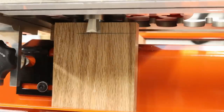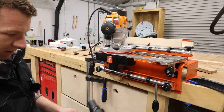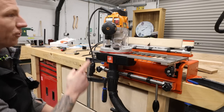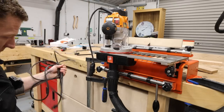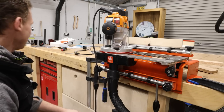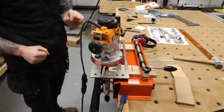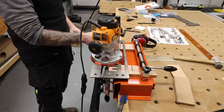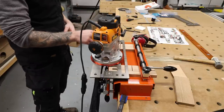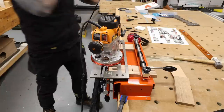We're almost ready to make the cut. I'll attach the vacuum attachment — it's a magnet that just clips on, very handy — and connect the dust extractor. Now the very first thing to do for half-blind dovetails is a scribing cut first: just a light cut across the front of the outer piece to establish a shoulder line and prevent blowout. Let's put on ear protection and eye protection and get on with it.